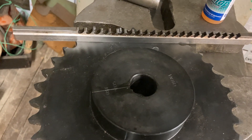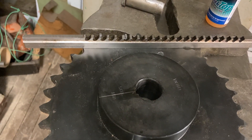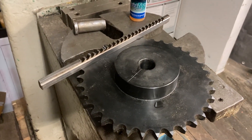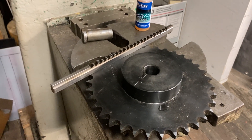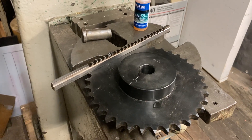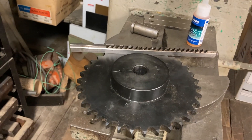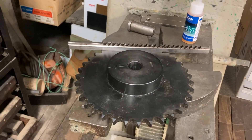It'll be a quarter-inch key, so it's going to have an eighth of an inch engagement in the shaft and an eighth of an inch engagement in the sprocket. All right, ten minutes — there we go, broaching. Lousy video, lots of talking, lots of background noise, but I can't do a redo because I don't have another sprocket. Titan Machine Tool signing off. See ya!